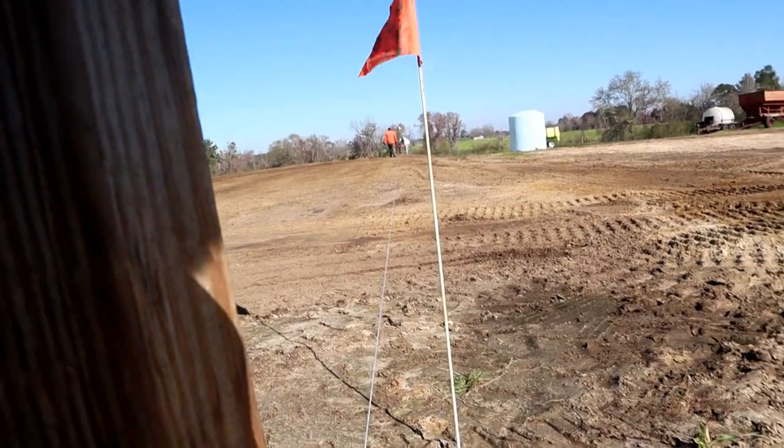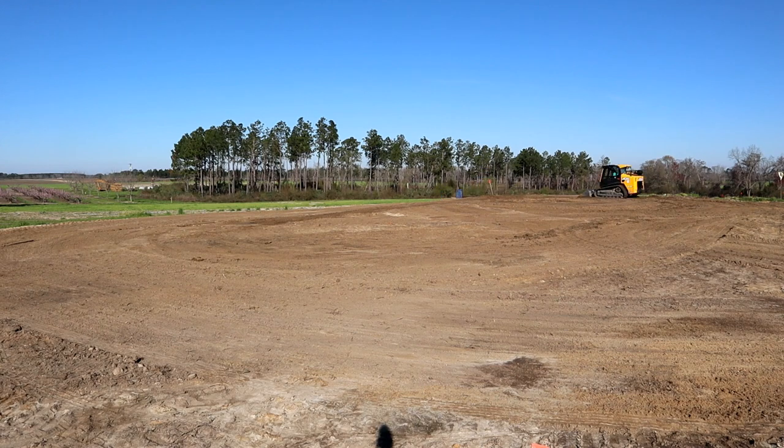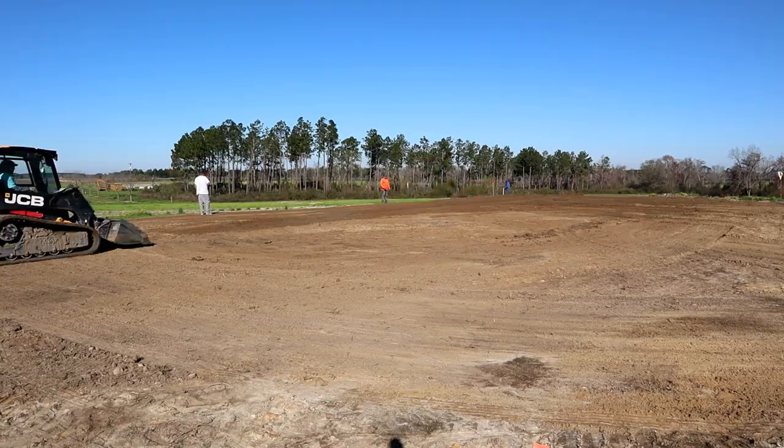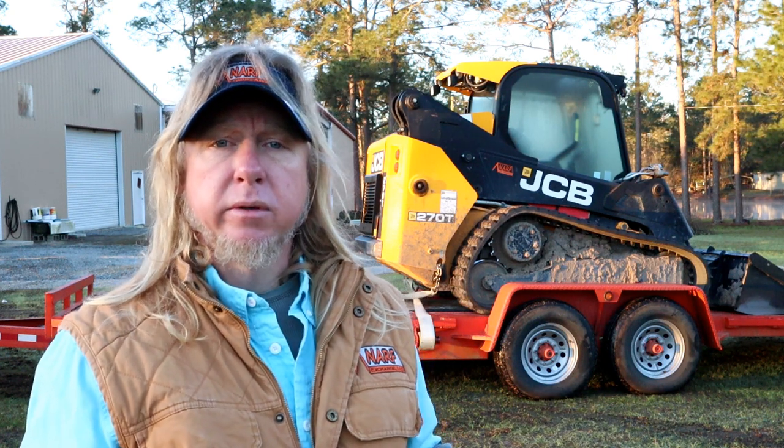A big deal with laying out a foundation is getting it square and getting it level. If these two things don't happen in the foundation, the rest of the building, the rest of the project will show up the unsquareness of the foundation. And then each trade gets blamed for a bad job because it all started with the foundation not being square. Get the foundation very square. That way, from then on, the build goes perfectly. You can get everything plumb, level, and it all looks good.